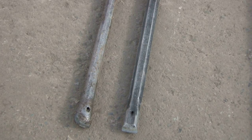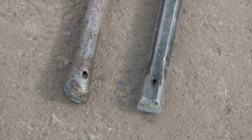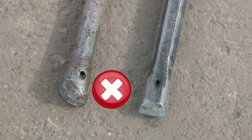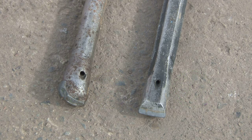Check the working tool you are using is sharp and fit for purpose. The one on the left is worn and should not be used; the one on the right is okay. A worn tool will cause more vibrations through the rock drill, which will be both uncomfortable for the operator and put more wear and tear on the unit. The work will take longer and require more effort.